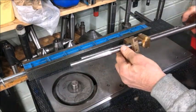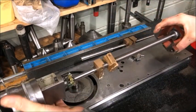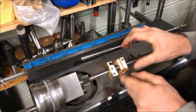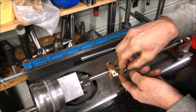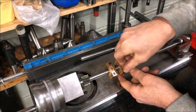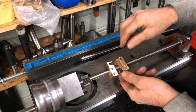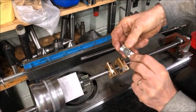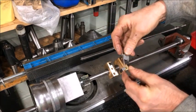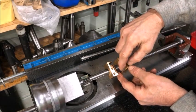These pair of nuts form a backlash compensation adjustment. With splines, there are screws mounted to — it might be a little bit tricky to see — but there is a slot where you have some triangular shaped pieces, one on each pair of gibs. With the mounted piece in between, you press down and can adjust the backlash to force these two nuts apart.